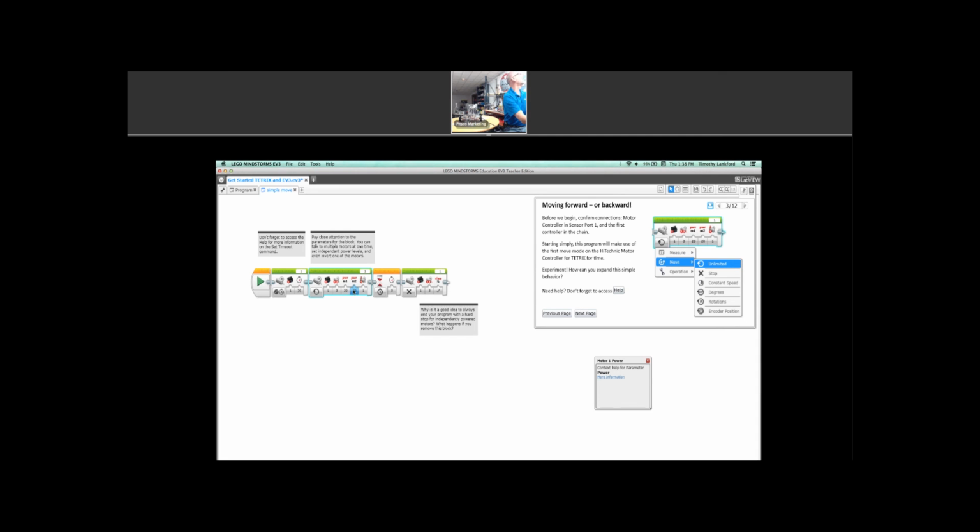So I'm talking to two motors. I'm giving them the same power level, which in theory, if I've got two motors mounted in opposition and I'm giving the same power level, my robot should drive straight. That's the idea. Now, because of motors in opposition, I am reversing one of the motors. Physically, if I have them back to back, for them to work together, one has to turn in one direction, the other one has to turn in the opposite direction for me to get motion that is working together. And I hope people could see my hand directions there. I hope it made sense.